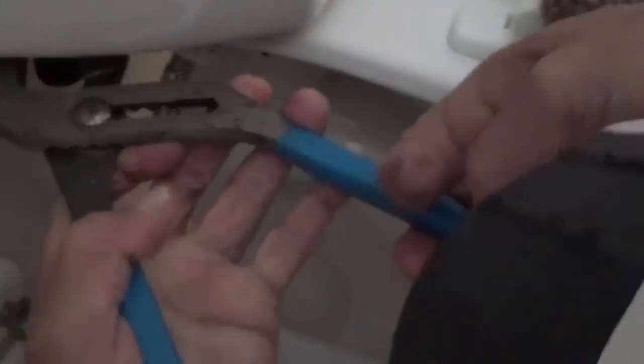So there it is — I want this little nipple right here lined up with the overflow tube. The refill tube will go on there. I went ahead and cut it because it was a little bit too long — you don't want it to touch the cover when you put it on. So it's hand tight. I've already done the orientation and aligned the new valve accordingly. Here I'm just installing the nut to the fill valve.